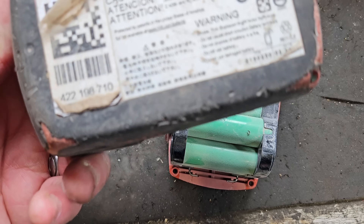If you are doing this yourself, it's important to understand these cells. This is the negative side and this little raised-up piece is the positive side. These cells are standard in nearly every battery except the stacked lithium they have now. You connect the red onto the side with this raised profile and you connect the black onto the flat side.